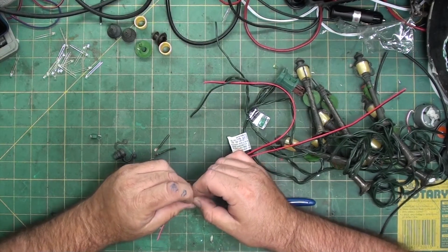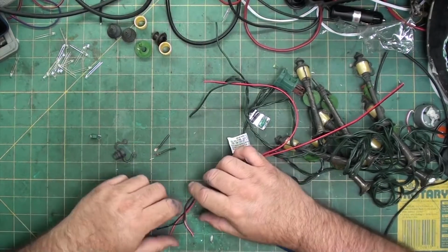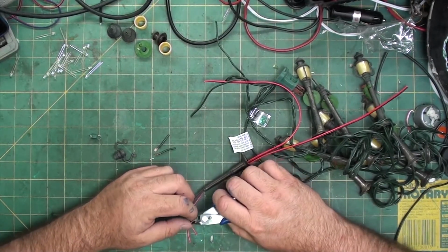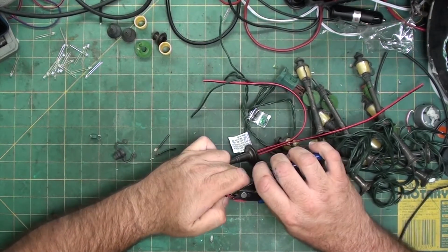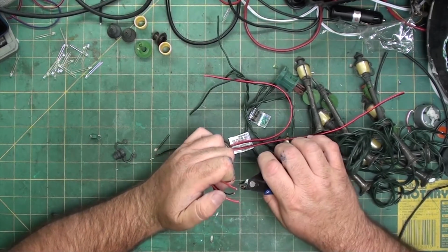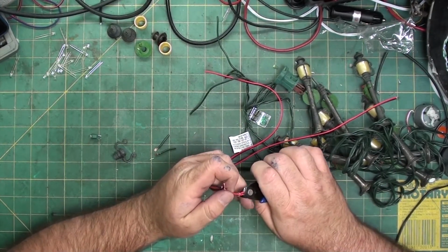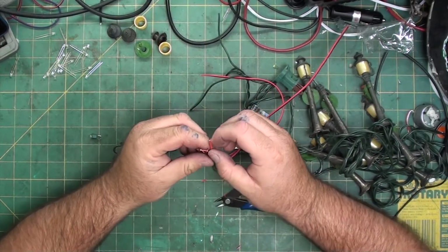If you ever buy rope lights or strip lights, the LEDs that come in a circle on a little disc, if you ever read the instructions, they'll tell you that you shouldn't go above a certain distance. Generally it's 16 feet, and that's because you start degrading the light quality. On a lot of lights, especially white ones, you can notice real fast that the farther the lights go when they're wired in series, the dimmer they get, even in that 16-foot run.